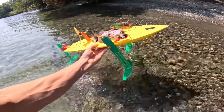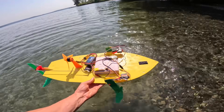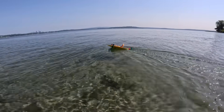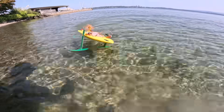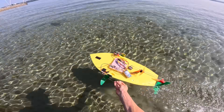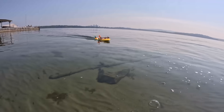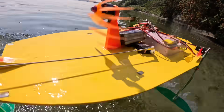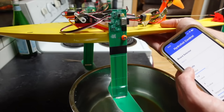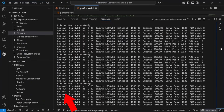After observing the servo movement more closely, I realized the slave unit would occasionally lose its smooth proportional response — it was like the P gain would randomly get turned up to infinity. This was indeed a bug in the production code that the factory had uploaded to hundreds of masts, so that was a huge bummer. I spent weeks sending videos and emails back and forth with Tamash, and eventually he discovered that the slave device thought the master would keep sending new parameter sets even though it didn't, which was making the proportional gain go to infinity.